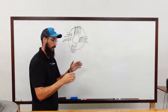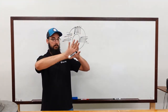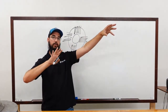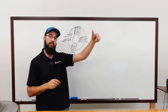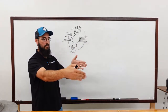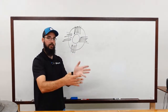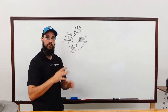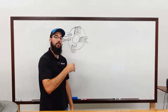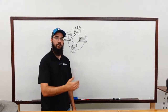Because on a YMC squared, if you're standing on the control cabinet side of the chiller, you've got your OptiView control panel and your VSD control panel, and that feeds everything over power and communication to the other side. If you walk around the other side of the chiller, on the very back end, where the motor is, you'll have your bearing control cabinet. That's all that's inside of there. You'll open it up, there's all kinds of boards and gizmos, and those are to run these bearings. And again, they're all pulse width modulation, PWM. Study that term.